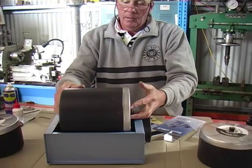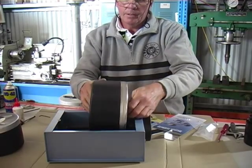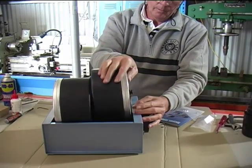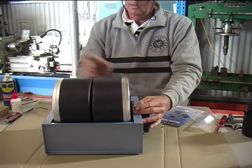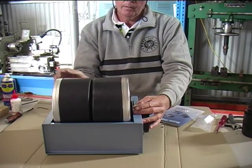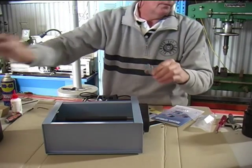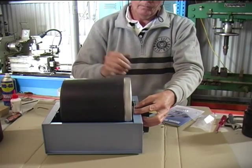Either comes with a full 12lb barrel, single barrel, or two barrels being 6lb each. We have a barrel guide to fit — the barrel guide fits in there, it's just got a screw that you need to screw in before you start to operate. Always run the barrels in a 6lb configuration with the lids facing outside of the machine. If you're running the 12lb barrel, operate that way and use the guide.